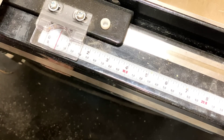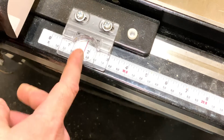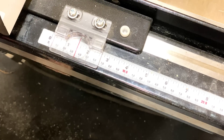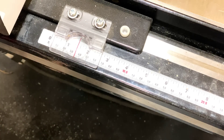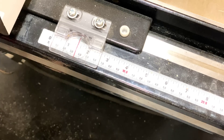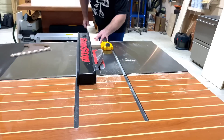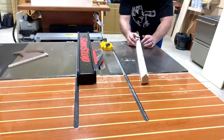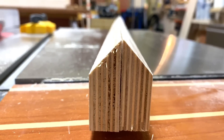I'm going to take half of the width of the material, which is one and three quarters. That's exactly half, but I'm going to minus half of the thickness, which is three eighths. Most plywood is just a little bit thinner than advertised, so we're going to knock off just like a thirty-second of an inch as well. Now we should be good to go — let's make our cut. That calculation gives me exactly two halves with no guesswork.